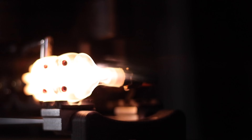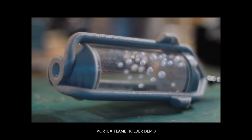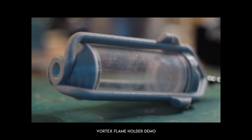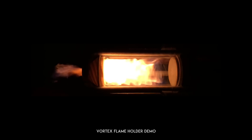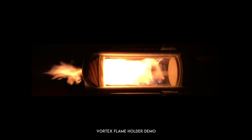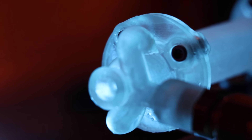What we're testing here is vortex cooling. Oxygen gas is injected into the chamber at a tangent such that it swirls around the perimeter of the chamber. This creates a boundary layer of cool, pure oxygen between the hot, combusting core and the chamber wall. Oxidizer is injected at the nozzle end, just before the nozzle starts to converge.